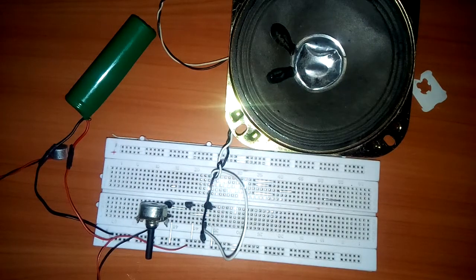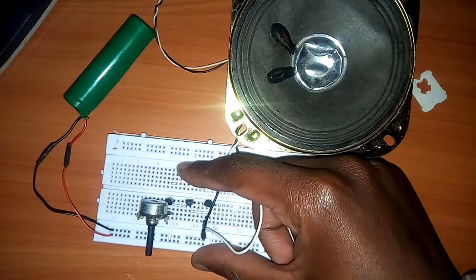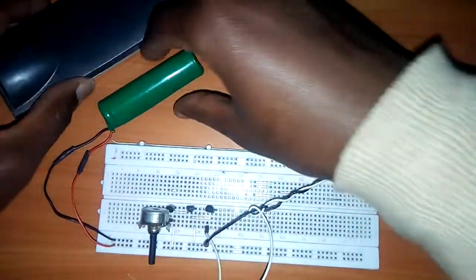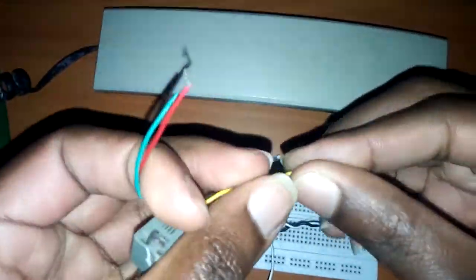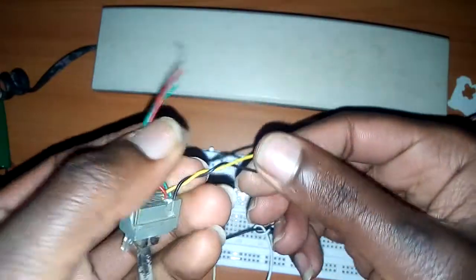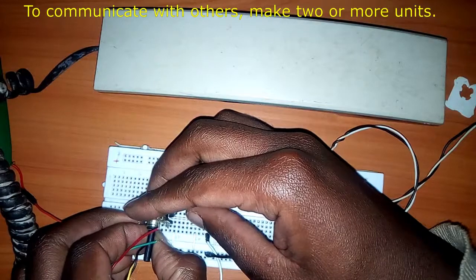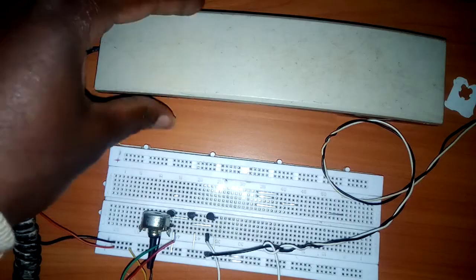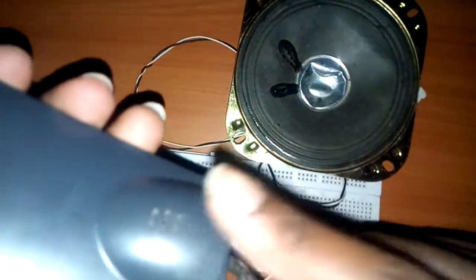You can use an old telephone receiver like this one — this one is better, so I'm going to replace the mic with this receiver and see how it works. These two wires are for the microphone and these two wires are for the speaker. I'm going to use the microphone only. I'll move the speaker here — you can see it's oscillating, meaning it's already working.